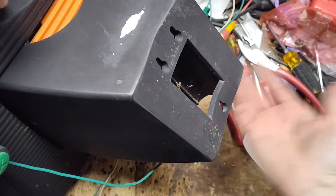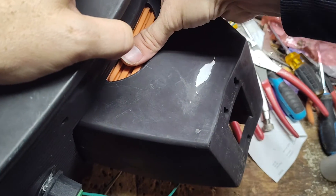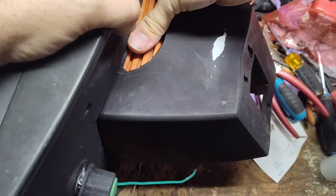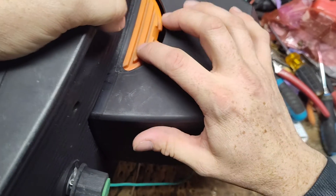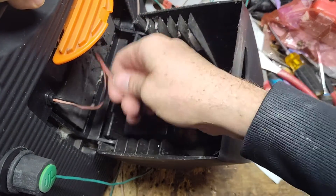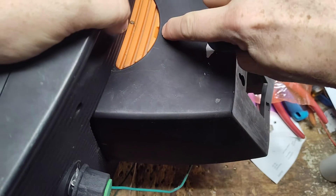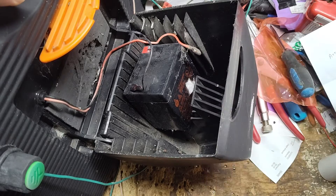Alright, lift it up off the table so the battery box is not resting on the table. Put your thumb crossways across it. Being right-handed, I turn it to the side and basically put my shoulder weight into it, pushing it down while rolling this back at the same time. Once you get past this piece here — this piece goes over the top of the other one — once it's started, it's easy to open. There's another way: get a flat screwdriver, hit the little notch right there, lift off the table, push down, and it pops right open.